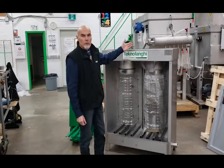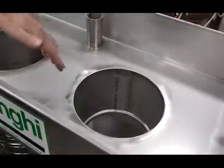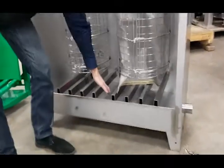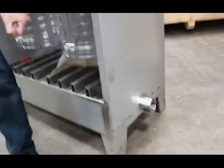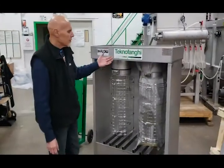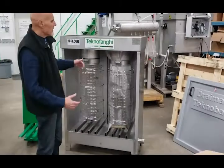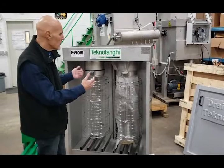At this point, we're ready to introduce the sludge into the top of the box, into the header. The sludge will flow inside the bag. The water that's filtered will come out of the bag and be collected into this bottom hopper and flow out this bottom drain. This is a process that can be continuously done several times. We can fill the bag, the sludge will be captured, and the water will filter out — just keep going until the bag cannot accept any more sludge.